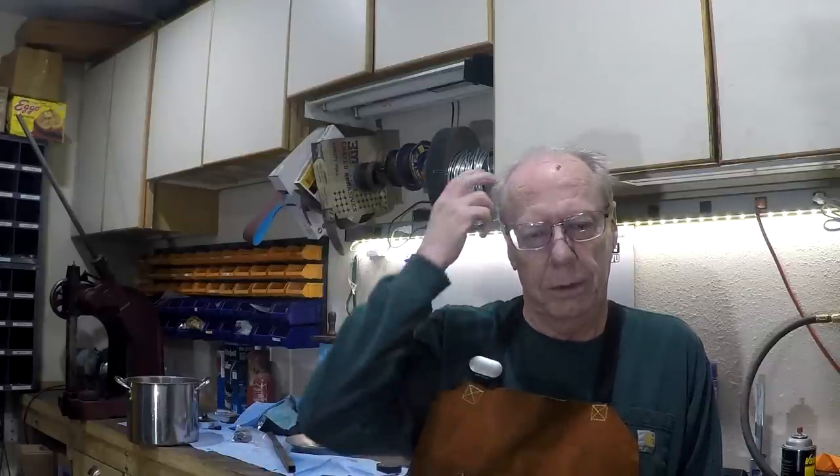My name is Bob, and this video is going to be about my 13-inch South Bend lathe. The lathe had developed a problem, and while I had it apart, I decided I would fix a couple of other problems in here. One of them is a little bit of backlash on the back gear. The back gear needs adjustment, as it's slipping out of mesh when it gets load on it.